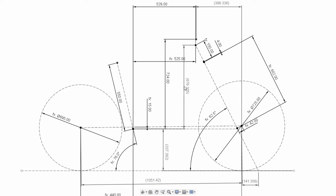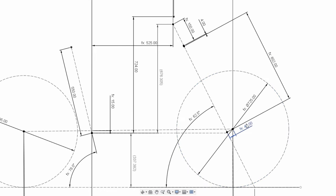676 millimeters. So that's kind of a byproduct of the length of the head tube and the fork axle to crown. Head tube as well, I've gone for quite a long one, 150 mil. So that's to try and get the front end of the bike real nice and high. Offset, just took that off the website for the Manitou Dorada, I think it was.